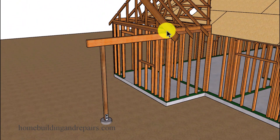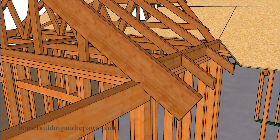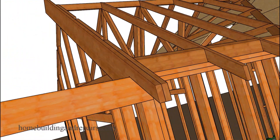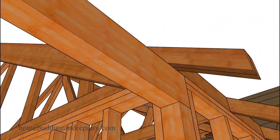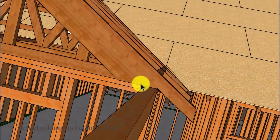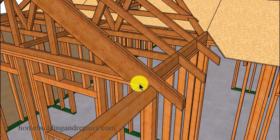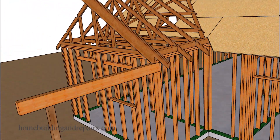What about when somebody installs a porch beam even with the top of the framing plates because they haven't taken enough time to do a little planning, and they end up destroying the bottom of the roof rafter to make it fit? I come across situations like this where that section of the roof rafter is not structurally supported. In reality, you just took a 2x10 and turned it into a 2x4 or a 2x6, when all you needed to do was lower the porch beam — unless you're not going to have enough headroom.